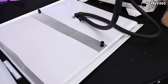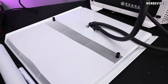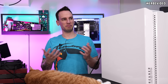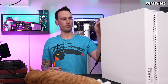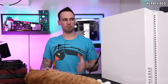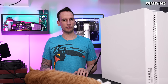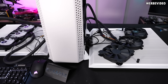She is quite skeptical about this solution, and honestly I'm also a bit skeptical — I have literally no idea if the gap will be too large or too small. I applied the foil on both sides to find out. Well, that didn't work out. Looking at the chart, we're back at 41°C — pretty much stock condition. The airflow through that gap is probably just too low, and even with the fans at 100% speed, removing the front panel and dropping to a comfortable RPM like 800 would put us right back where we started. This is not the solution.